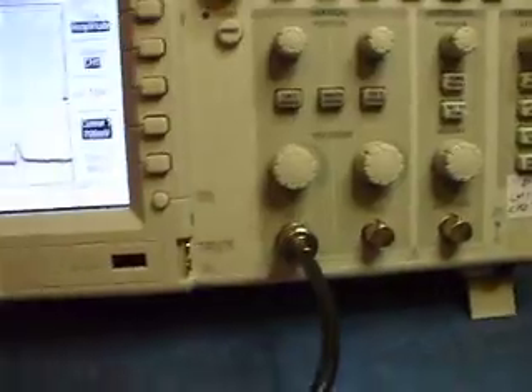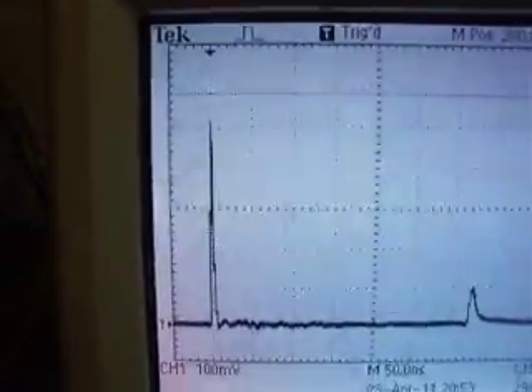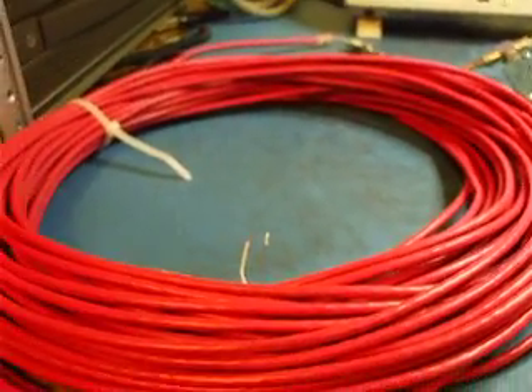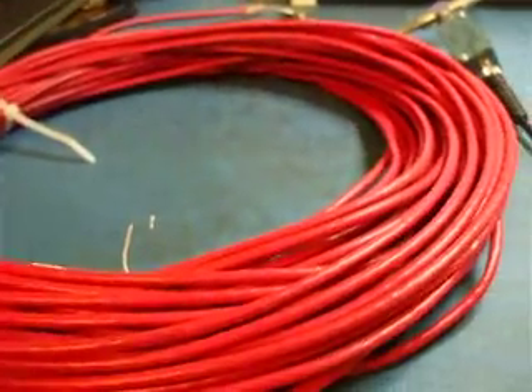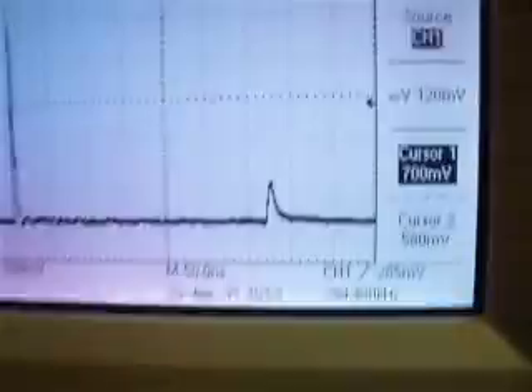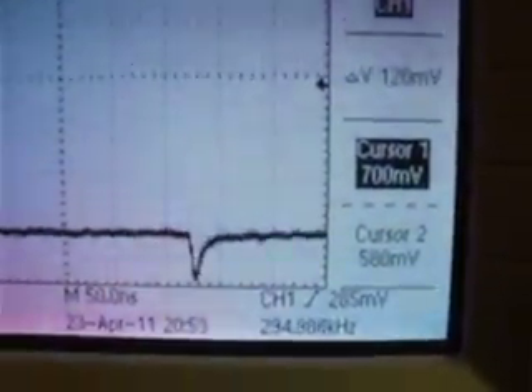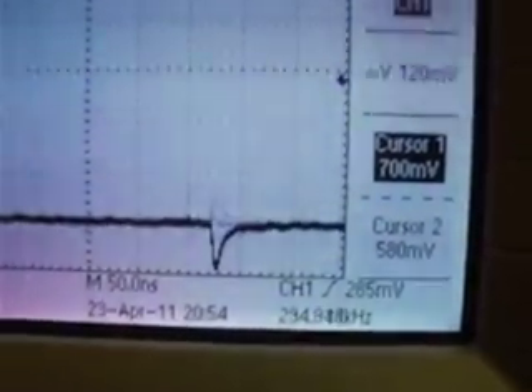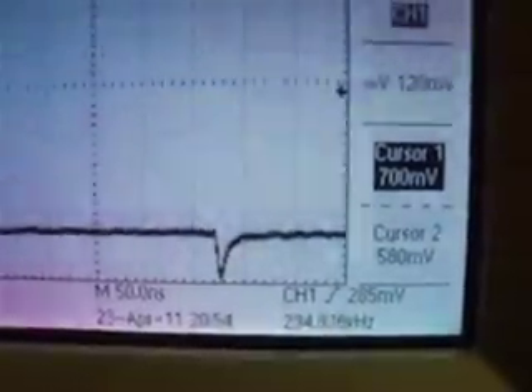We have a pulse that goes down the wire. According to the footage marker, it's 110 to 112 feet of wire. And we see we get a spike. If we short the two wires together at the far end instead of there being an open condition, there'll be a short — which is useful when you're checking wire to figure out why it isn't working for you.